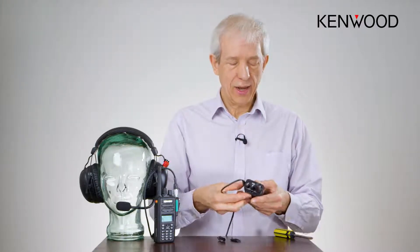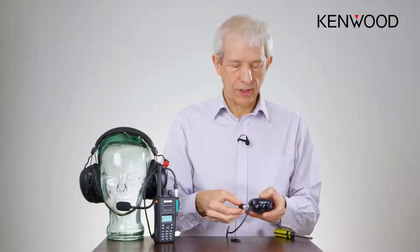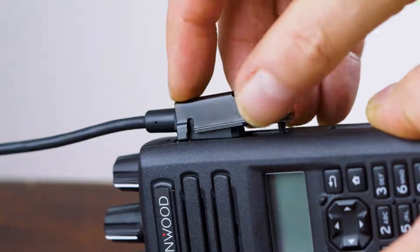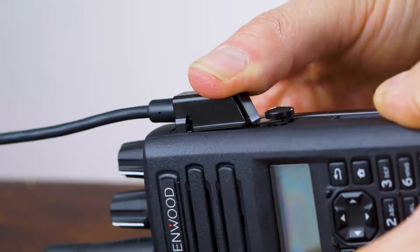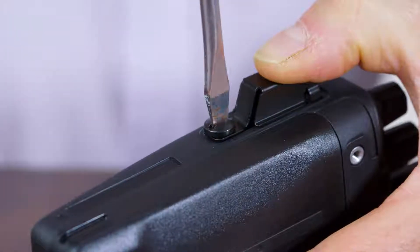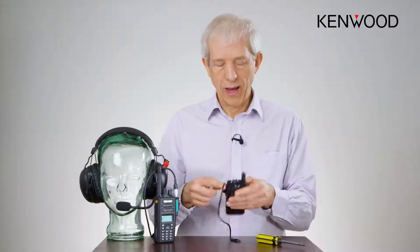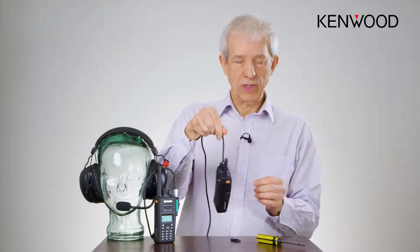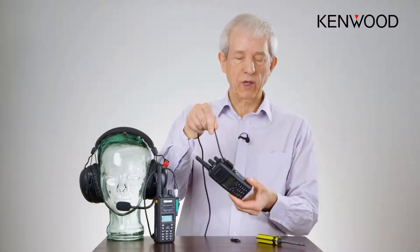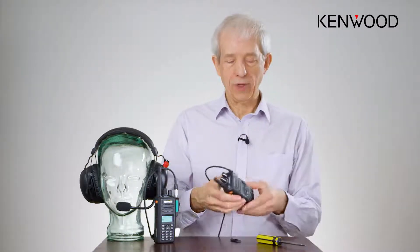However, because this is just a straightforward push-in it is not incredibly reliable during normal operation. So what we have is a little metal adapter that simply gets taken around the cable, slipped in here, and you then compress this. There is a screw done up underneath and as that screws down it compresses the connector and completely surrounds it, so even if the radio is dangling the connector cannot come off.